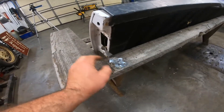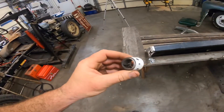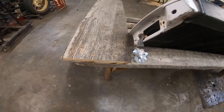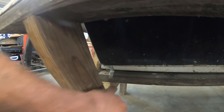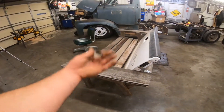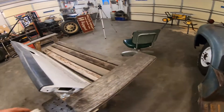I screwed the floor joist hanger to this upright. That's where this plumber's tape stuff comes in — I found out the proper name for it after I was done. Take a roll of this stuff, screw it to the tailgate, straighten it out, screw it down — that's what you need next time. A floor joist hanger will work if you've got one laying around. Down at the bottom, plumber's tape would have worked well here too; I just used a shelf bracket with a couple of self-tappers into the bottom of the tailgate and a couple of torx screws into the bottom of the bench. Leave all that loose until you can sit in it and adjust the angle — I don't know what degrees that's at, like 16 and a quarter. We'll just call it that.